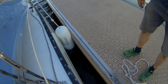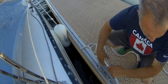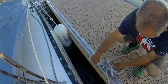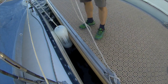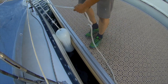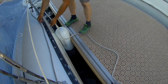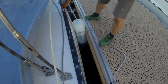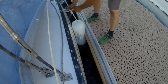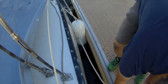The controller was defective. Once I put a load on it, it basically cut out. After doing a ton of experimenting, it didn't matter whether I was at 30, 50, or 80 amps — once there was enough of a load, the controller cut out. The actual settings were correct in the motor. Once I got a new controller from Golden Motor and a cable, I could see the settings were correct, but the motor still cut out. It was the new controller that ended up getting rid of all my motor issues — basically it would turn on, start moving, then go beep and reset. The controller was rebooting.